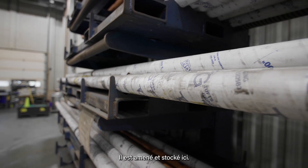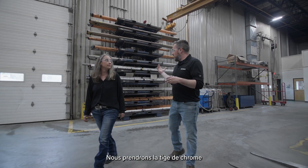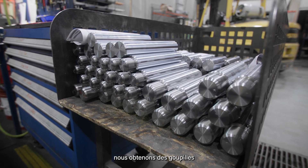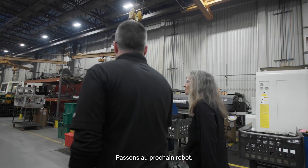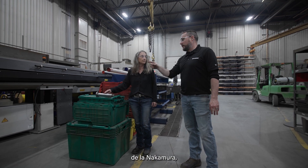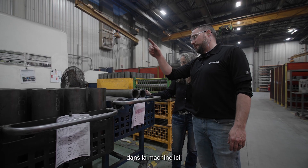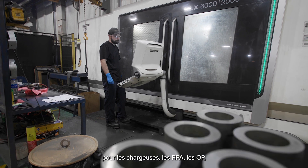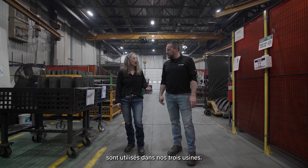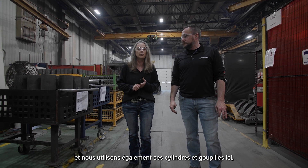We get the chrome in and store it here — all different sizes for all different applications of pins and cylinder rods. It starts right down here on the Nakamura. We take the chrome rod based on the job, cut it off the rod, and do the threads on it. Right here we have a set of pins that are built and a set of rods built for one of the cylinders. We then move into the next robot in the sequence — Robot One is a dual-function robot because it welds the pin heads onto the pins finished off the Nakamura, and it also welds the rings on the other side. We do all kinds of cylinders for the loaders, the RPAs, and the OPs — everything is done on this line. All of our cylinders and pins supply all three factories: they get sent to St. Justine, Littleton, and we build with our own cylinders and pins right here.